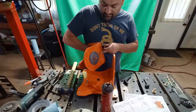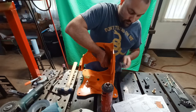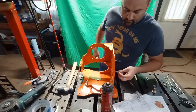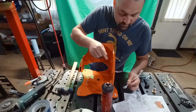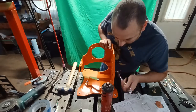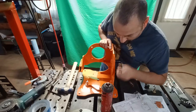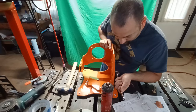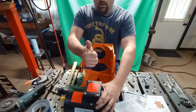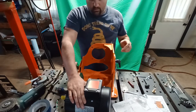I've got my disc and my thrust washer on there. I'm going to put it through here, put my washer on there, then take your spring plunger, put Loctite on it, and install it. If you've got paint in the threads, grab your 13mm wrench and tighten it. The nose will compress — that's fine. Thread it in to get a nice engagement. When you install your motor, make sure the part for your electrical connections is on the top. If it's on the side it'll probably get in the way — I recommend the top, it's the easiest place.